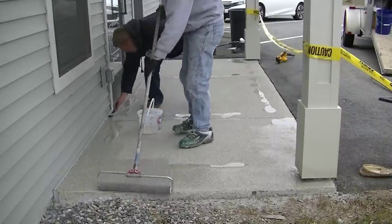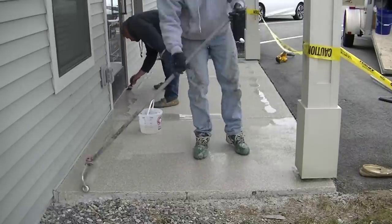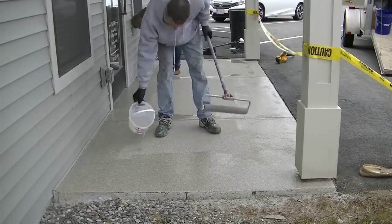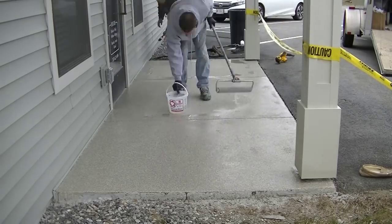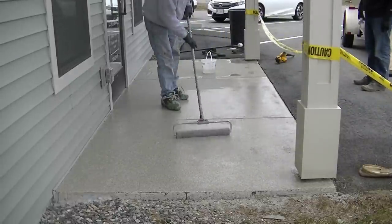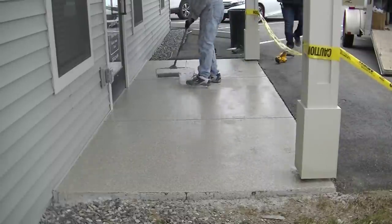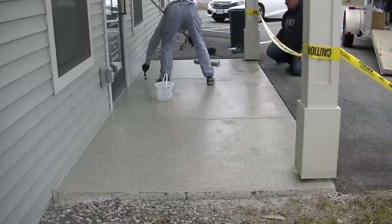The coating itself does have a little bit of texture to it when done. We do this type of coating in garages all the time — tons of these coatings — so it's also a really good garage floor coating. We get the coating on nice and even, then broadcast the non-slip aggregate right into the surface — it kind of disappears into it but leaves a non-skid texture. This is a business, so the entryway gets used a lot and they need it clear in winter and non-slippery.